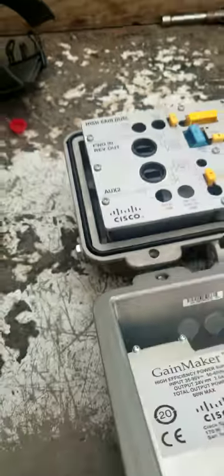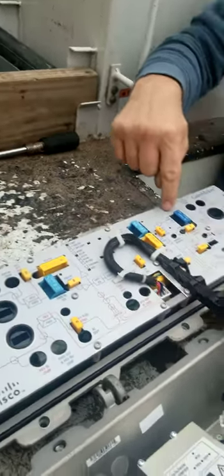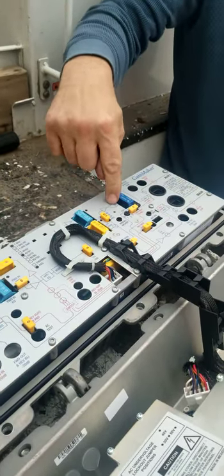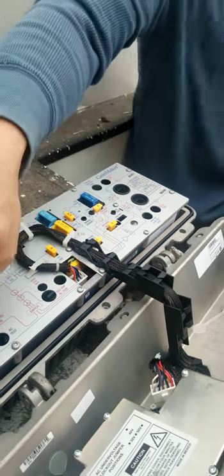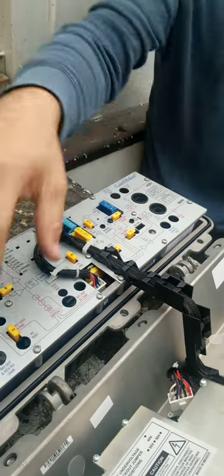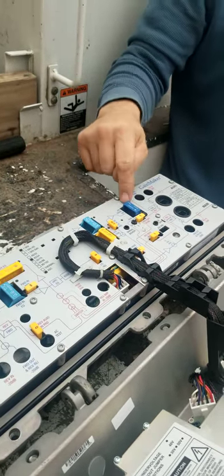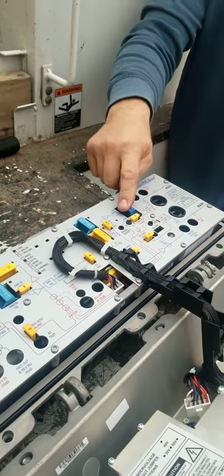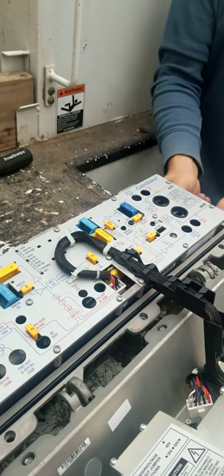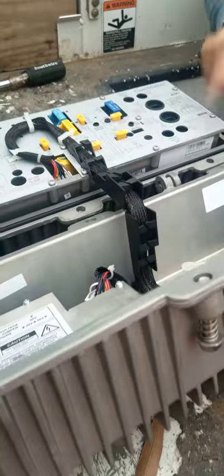If you ever have to balance an amp, this is a signal director. As you can see, this port has been terminated. 75 ohms is terminated, so this port is not being used, just in this case. There's internal two-ways and DCAs and stuff like that, too. But just for training's sake, these two ports are active. Main will always be active.